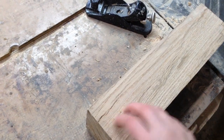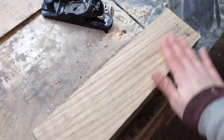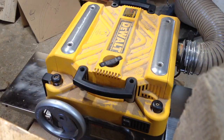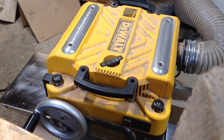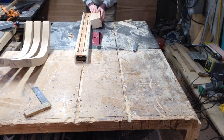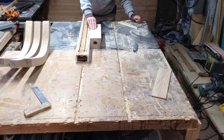For the central portion I had a large block of red oak. Once the piece is finished you won't be able to tell it's red oak versus white oak. I was going to use this for the middle. There was some surface checking in it, which wasn't a big deal. I don't have exact dimensions on this because I never measured it — it was just big enough for what I needed. I squared it up on the table saw after planing it down.